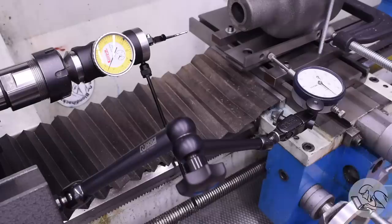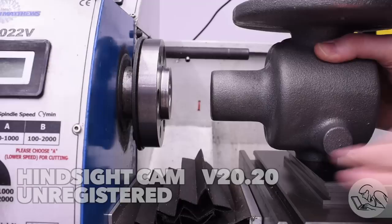It's a bit of a judgment call here and you just have to do the best you can with centering things on castings like this, but I'm happy with that. It actually occurred to me while editing that I could have probably just brought the casting up to the spindle nose on my lathe and lined it up by eye — much like you would a gauge pin on a cast boss that you're trying to drill in the center of. This just didn't occur to me because the kismet of the nose on that casting being very close to the diameter of the chuck registration on my lathe just never happens. But hey, if you get this lucky, keep that in mind.